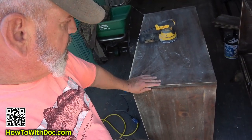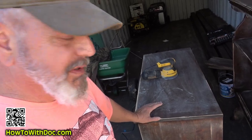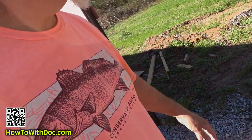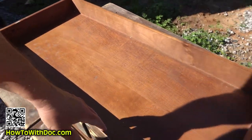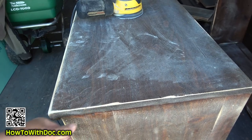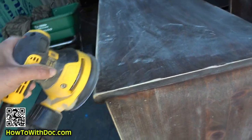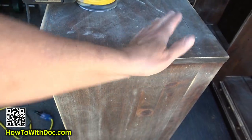So one of the things I'm doing to give this more of an aged look — here's a funny note. We just opened up a drawer and the drawer has that old Ethan Allen logo. All the drawers are dovetailed and they're all solid wood. See if you guys can figure out when it was made — there's the old Ethan Allen logo right there. These are all solid wood dovetails front and back. What I'm doing is I'm not applying gentle pressure. I'm coming into some of these edges and actually doing a little bit of a round-off on a spot or two. That's the wear you're going to see on an old antique piece — all these rounded bumps and gouges.